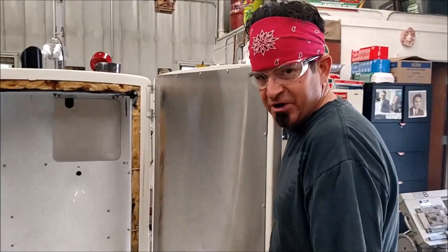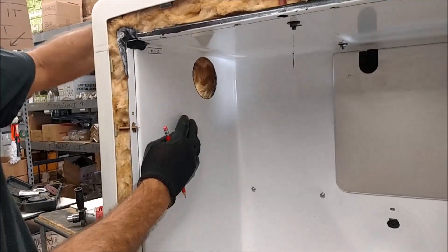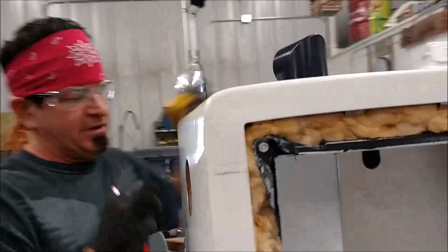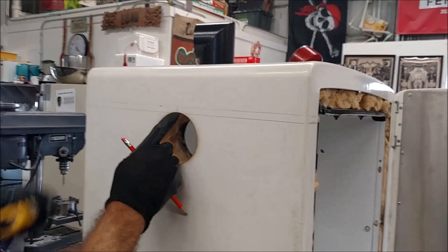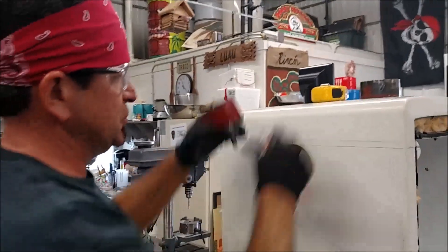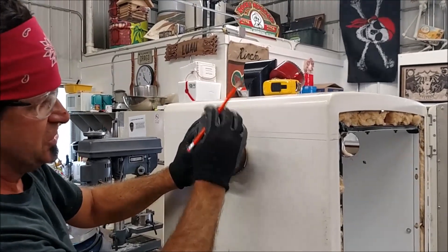What we did on the last refrigerator was a little bit smaller in size, but what we're doing is we're running a twin exhaust on it. The first thing you want to determine is how much room you have in here from the ceiling down, because there's going to be probably about a 4-inch space. You want to measure down to find your center. We found our center of the refrigerator, determined what the inside ceiling height was, and made a mark. We normally like to use a 3 and 5/8-inch hole saw — that works good for the type of exhaust pipes we're using. We're finding our center and lining up our hole saw so the top of the hole brings us just a little bit below the ceiling height.